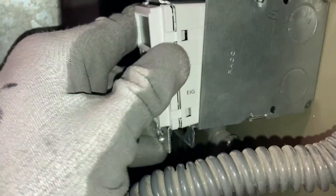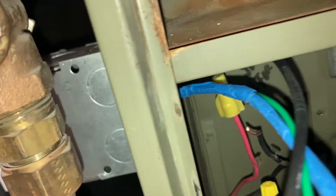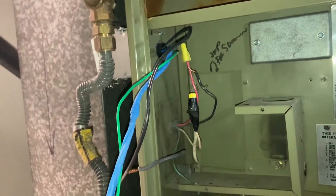Make the wire connections and screw the switch to the box. A deep box is preferred — it gives you plenty of room for the switch and all your wire nut connections. Black connects to the black power wire coming in, and the blue is power going out to the motor.